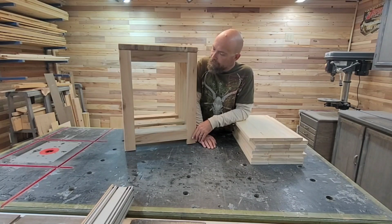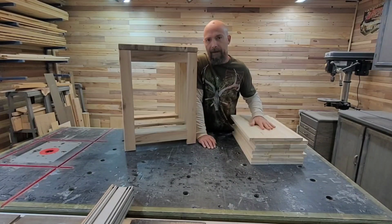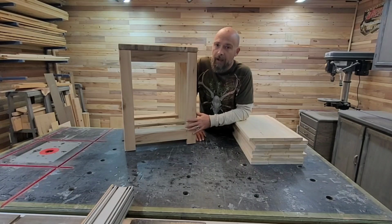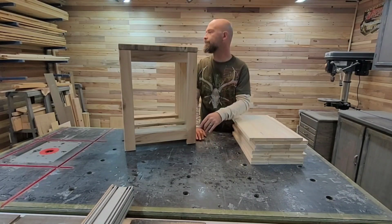So I reached out to her and we decided on 3 drawers instead of just 2. So we're going to cut these big panels that I made to do the 2 drawers down to 5.5 inches instead of 8.25 inches. I think that'll serve more purpose beside a sofa than 2 big drawers. Alright, let's take these to the table saw and we'll come down to 5.5 inches.